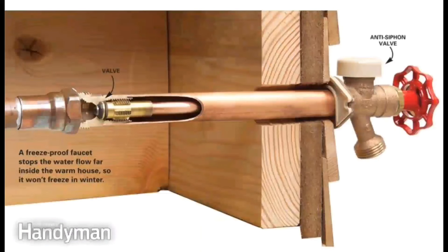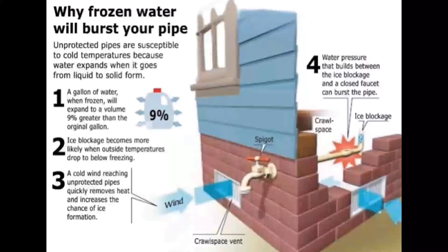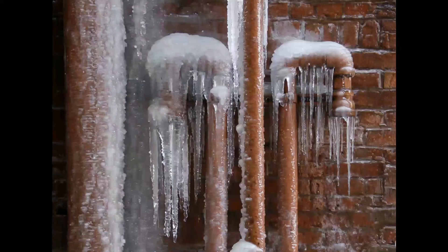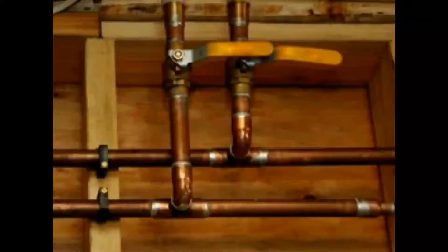Thawing enclosed pipes. If a frozen pipe is located in an area that you cannot easily access, you have options for thawing the pipe. You can attempt to thaw the frozen pipe by increasing the temperatures in the property — turning the thermostat up may be all you need to do to allow the ice blockage to melt. Infrared lamp: if you know where in the wall the frozen pipe is located, you can attempt to thaw the blockage by placing an infrared lamp in front of that portion of the wall. The heat from the lamp may be able to penetrate the wall and allow the pipe to defrost.